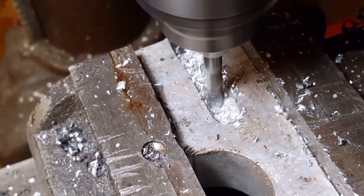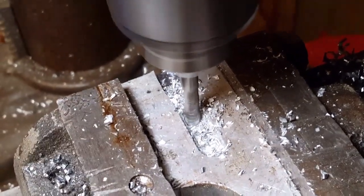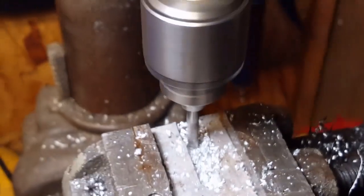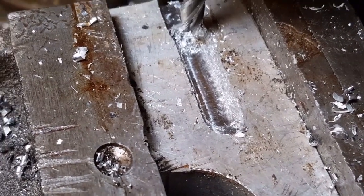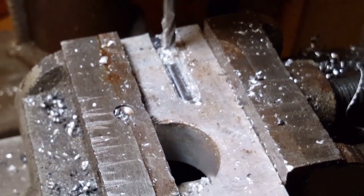You can still hear it cutting on the backstroke. A lot of mill guys will say you're not supposed to cut on the backstroke — I agree with that; this is for demonstration purposes only. Never run an end mill back across its own cut — that's the rule. You can see how the cut actually happened: it cut a little ways, everything's flexing. Whenever you go back, even though you're not supposed to, you get a little extra swarf off the cutter. So let's go to the milling machine, flip this part over, and do it again.